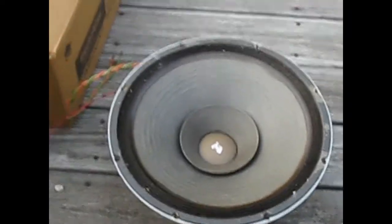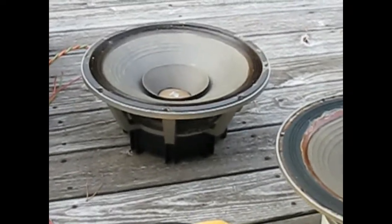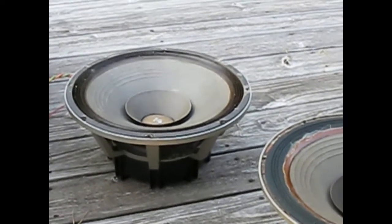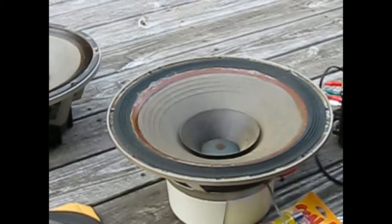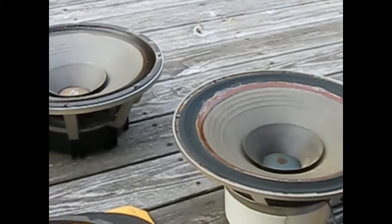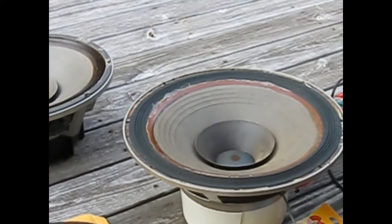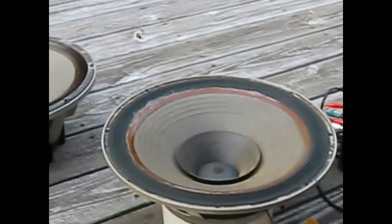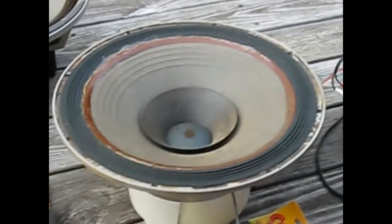I think the coil itself actually broke in half. So I'm looking for a good re-coner for these — someone who will do a good job re-coning an EV. I'll probably have to turn them into SROs to get them re-coned, since I doubt anybody's got this cone — lower wattage cones than the SROs, a little less mass for better fidelity. So I'm going to do a real hack job and glue the surround on, and eventually come back with a grinder to grind off that excess glue.